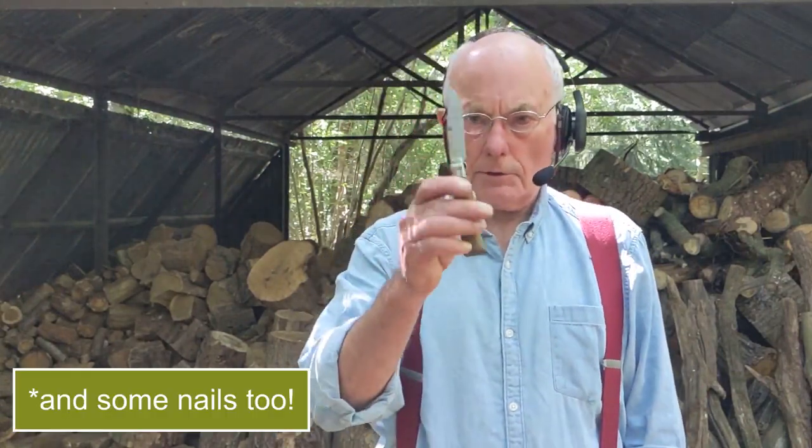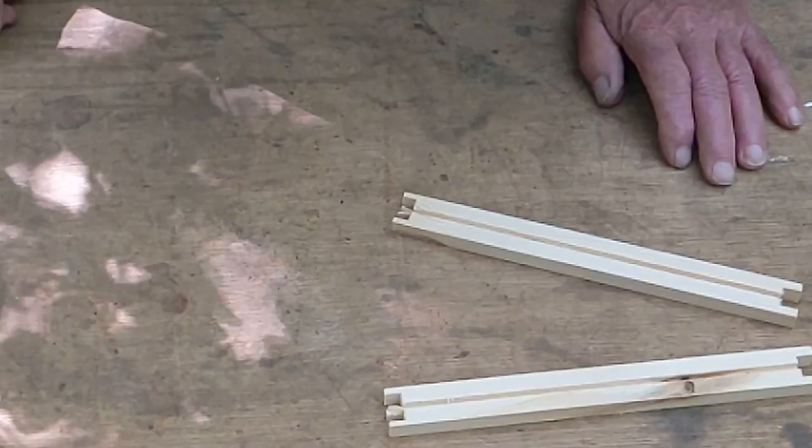themselves. All you need is just a pack of frames, a hammer and a sharp knife, and a flat surface to make a frame on, because you need to get it square. If you get it twisted, when it goes into a hive, the gap between the frame can vary. That can cause you problems in use. So make sure that you get your frames square and flat.